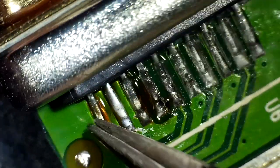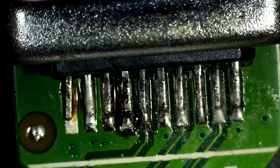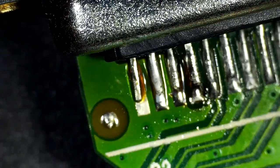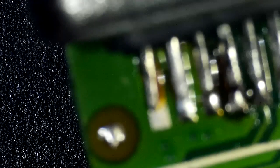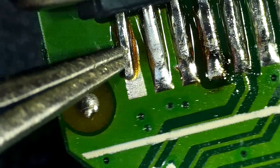Still a bit of a wiggle. It doesn't look like it's really soldered that well — the pad doesn't look like it's really connected to the pin. It could be that there's solder underneath. If we look from this angle, we can see that the pin is lifted but it is still soldered. I guess that's the problem with the lack of depth perception — I would have been able to see that so much easier with a binocular microscope. But I can just turn the board and hopefully see better. In this case, we're going to use some tweezers to push it down while soldering.